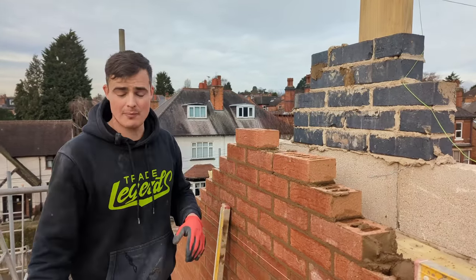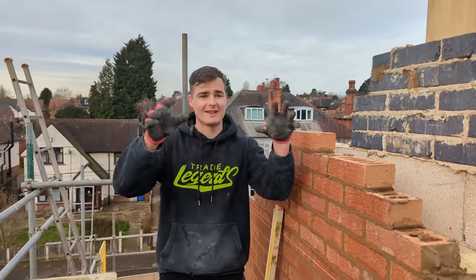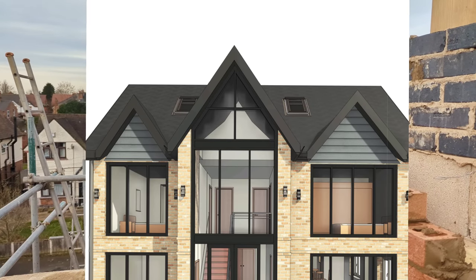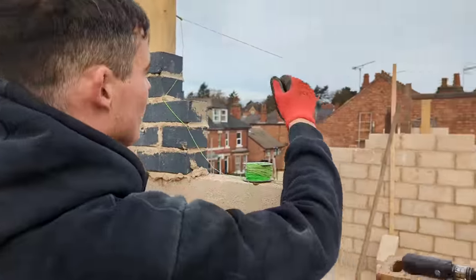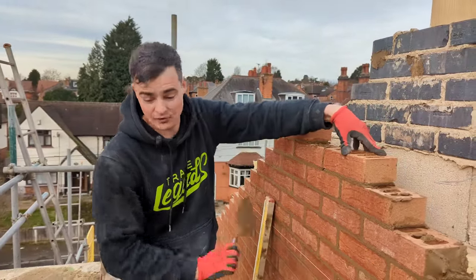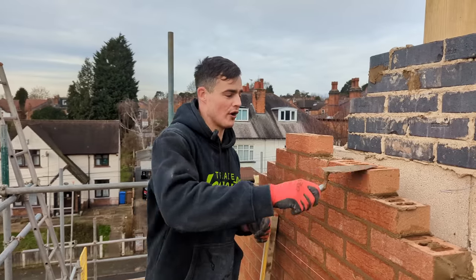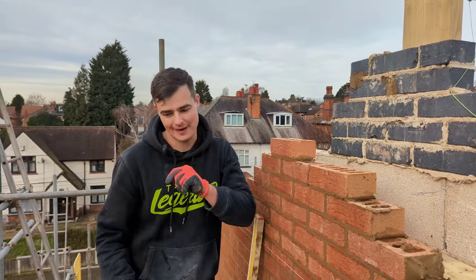Today, we're also gonna build across the front two lintels. The drawing shows that we have cladding. However, it also shows that we have a couple course of bricks going over some lintels. So we're going to sort that out. And finally, we're going to top off once again those two blockwork gables to full height because the steel is here and that is going to be going on Saturday morning. So right now, me and Drew are going to crack on. We'll come back to you in a bit.